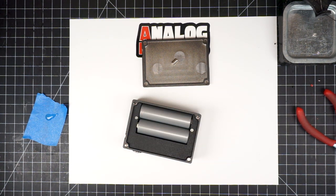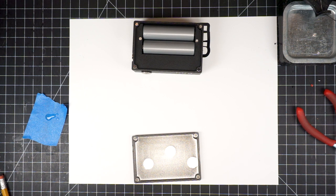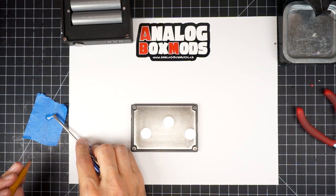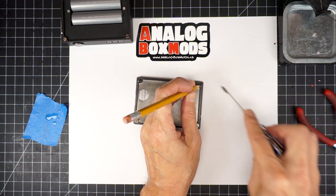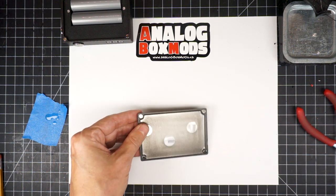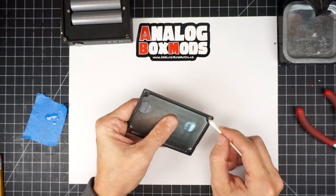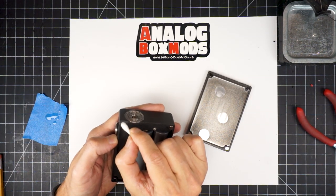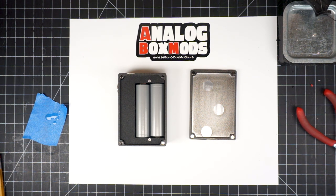And that's some CA glue, super glue that I'm using. In the early days, I would use epoxy for the lid magnets, but it's more trouble than it was worth, harder to work with. The CA glue works fine, and it's a lot faster. Now, if you have too much glue on there, it may squish out around the magnets, and it can dry kind of white and hazy. So what I'm doing here is I've got a Q-tip, which I dipped in some acetone, and I just do a little quick cleanup or wipe on the magnets. So we'll let that dry.